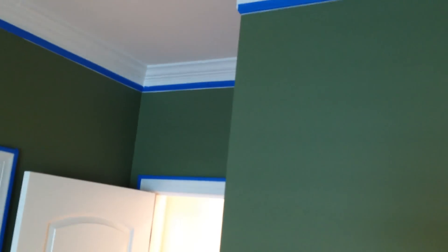This place has already been painted, but the homeowner knows me real well and told me she wants me to paint this house. I've got the tape exactly on the 90 degree, and what these guys did — you can already see it from here — they took the trim paint and bled it into the wall. So where the tape is exactly at the 90 degree is the trim, and the white you see is how they floated the trim paint into the wall.